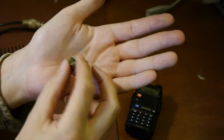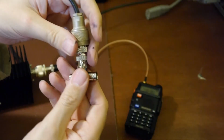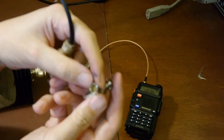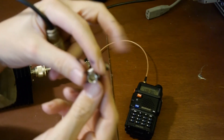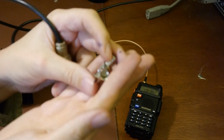So this central leg, when we're connecting our normal connector that goes to the analyzer, has a pin on it, but the pin isn't making contact with anything. There's actually an air gap between this BNC pin and the bit of exposed copper. Hopefully you can see in there.